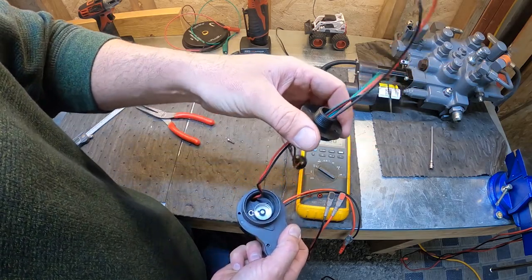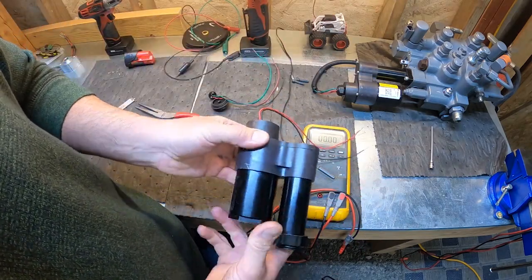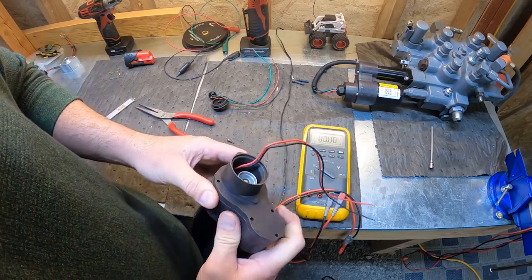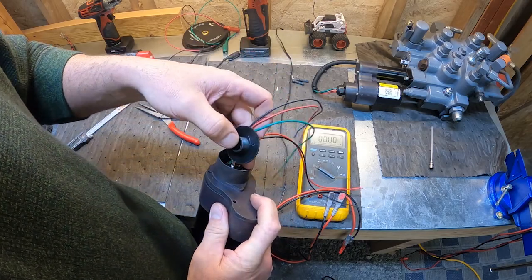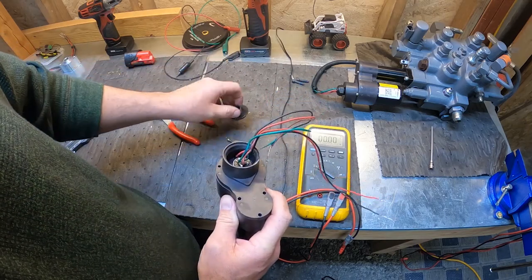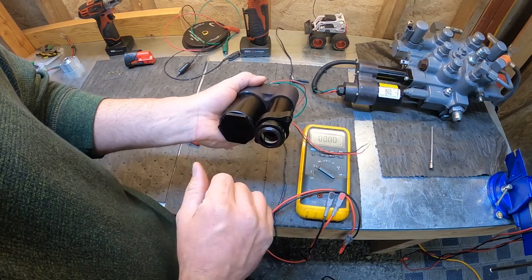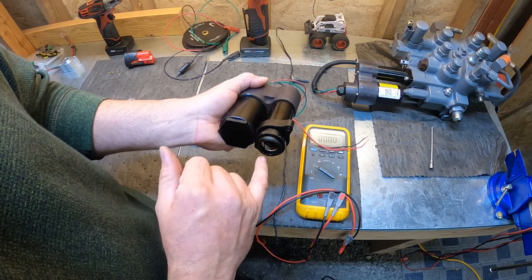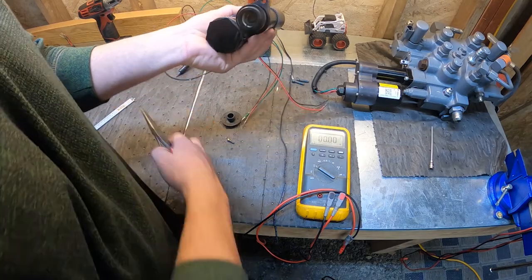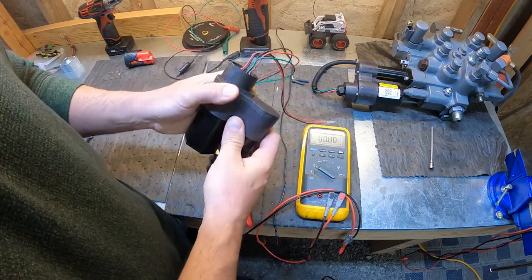I'll show you that, but anyways, we pull this cap off. And then we can pull the top off this actuator too if we had to. What I would do before you take the top off your actuator, use that 5-volt power supply and find out your position on your actuator. Find out exactly where 2 volts is just to verify. Before you take it off, you can move this actuator piston with a pair of pliers or something. I'll see if I can anyways. This one I can't.